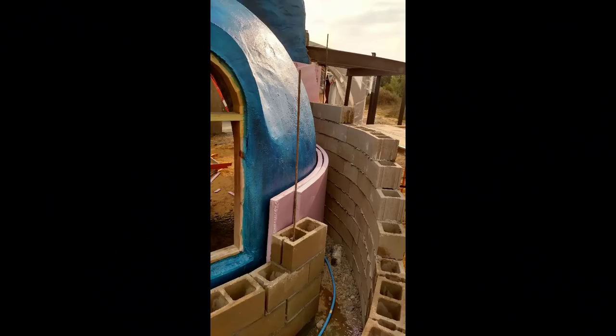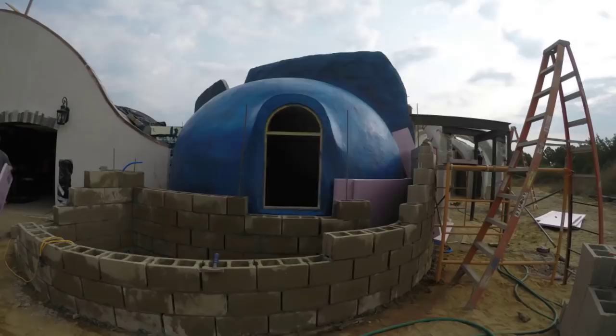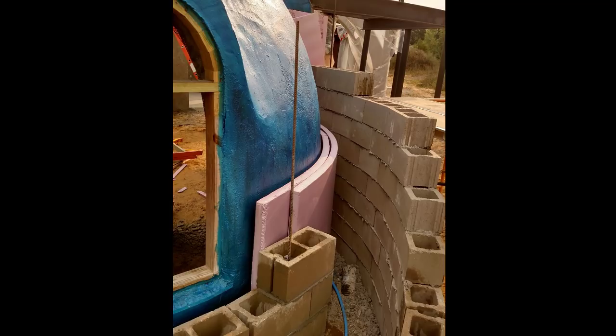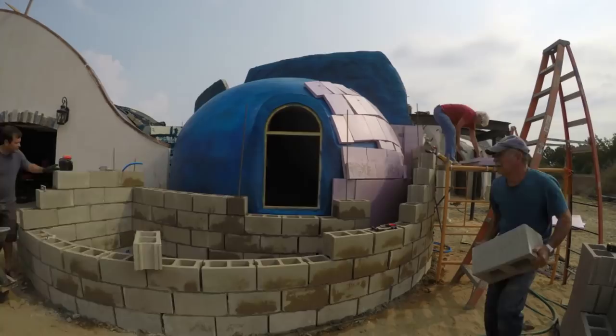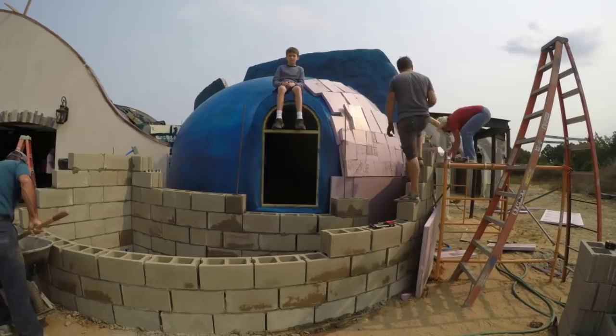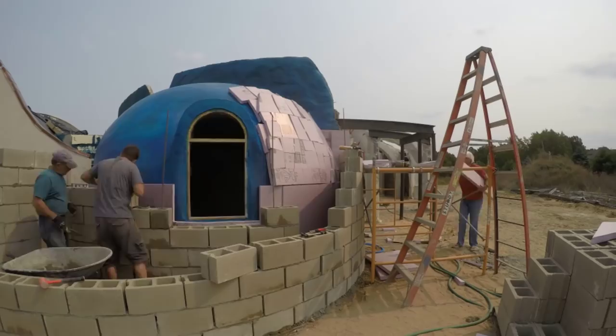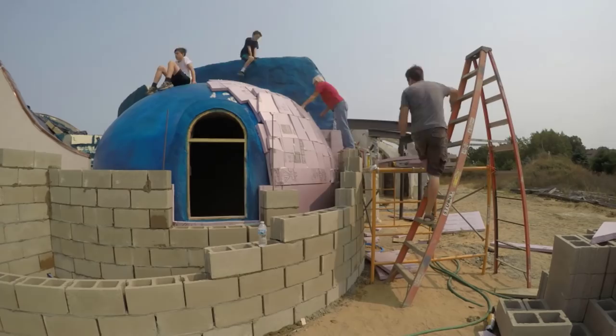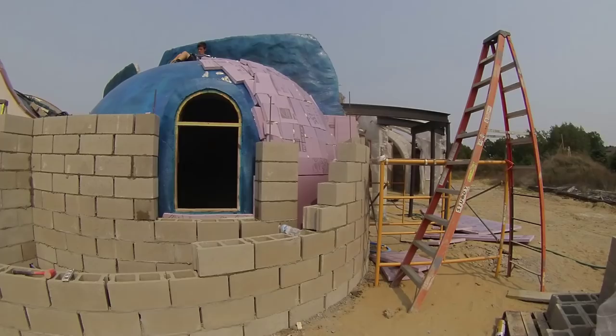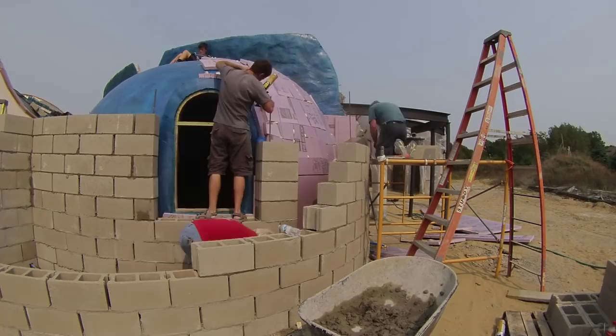After the retaining walls were part way up, we started putting insulation between the apse and the retaining wall. The first four feet of the apse is basically just a cylinder, so simple curvature. After that things get more complicated. At first I'd imagined slitting pieces of XPS so they would crack and curve and then figure out how to fill those gaps later, but pretty soon we gave up on that and started cutting the strips into parallelograms which we could orient in different ways to fit pretty well without custom cutting ahead of time. We basically glued them on with spray foam. After she got the idea, my mother took over as Puzzle Master with some help from the boys, and we continued with the wall. This top edge of the window dormer has simple curvature-ish, so I ran a bunch of two-inch wide pieces through the table saw with a blade at an angle to give me sort of the right angle for an arch.